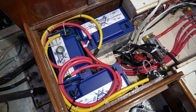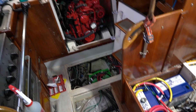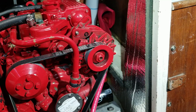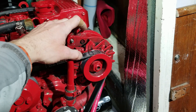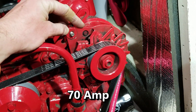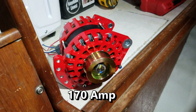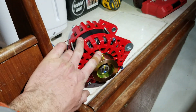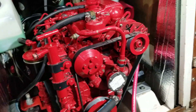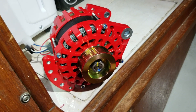Just wrapping up work in this battery compartment, and now we're working to get all of this connected up to our engine and our electrical panel. As part of our lithium battery upgrade we are also upgrading our alternator. This is our existing one — a 70 amp — and we're replacing it with this guy, which is a 170 amp. This thing will essentially turn our little diesel engine into a pretty powerful generator, so we're really excited to have this as a new addition to complement the lithium bank.